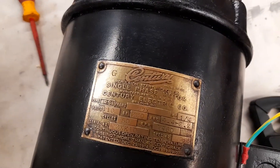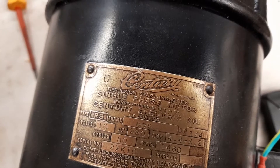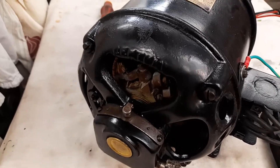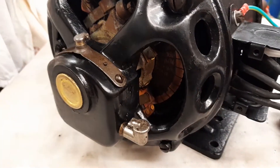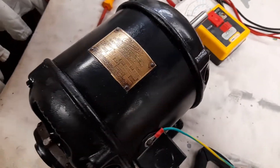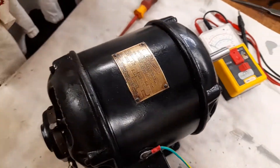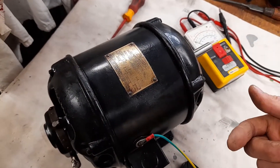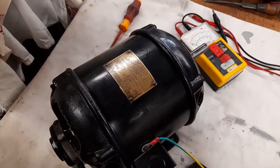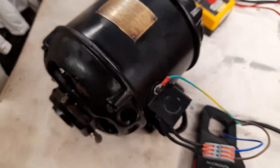The reason being because of the type of motor. It's a single phase, which you could easily get nowadays, but it's a repulsion start and then induction run. The gist of it is that there is a commutator at the back — you can see it there — and that gets the motor running. Then there's a centrifugal clutch which disengages the commutator, and then we're just using the stator, the stationary part with all the windings on the outside, which makes the rotor — the bit that spins — spin around. That's a very great simplification of all the detail behind this.